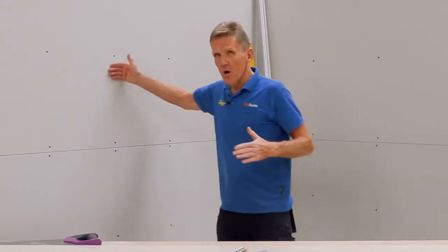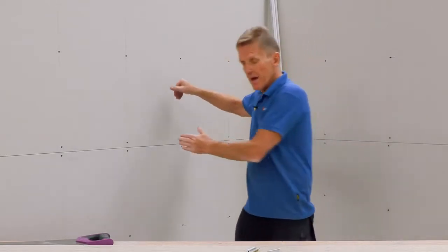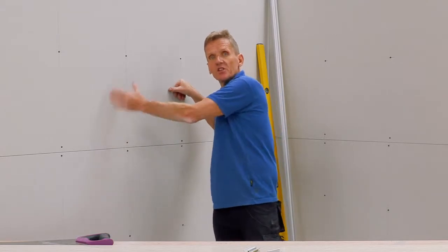So calculate that. Also work out where your end panel is going to come. Now if you're doing the whole room, you're going to carry on around the room, but you want to drop the panel down as it sails over the edge of the shower tray. That again is a standard sort of thing you do on tiling or anything else, but work it out.